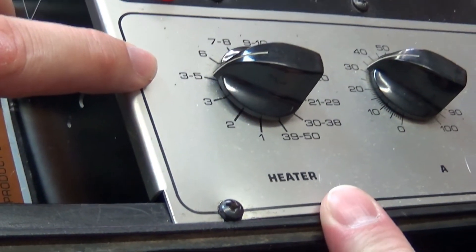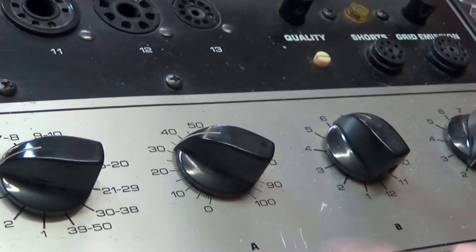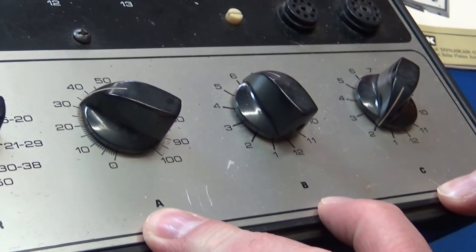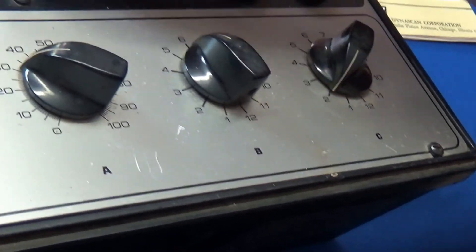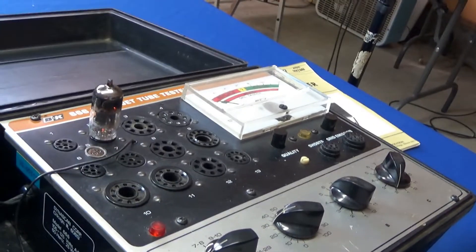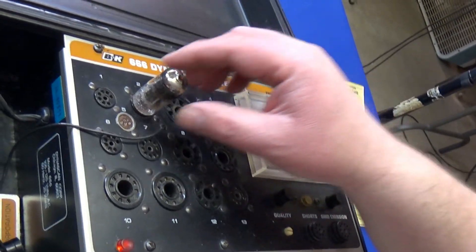That's pretty easy to tell by the first number off your tube. So it'll be 5 volts. This is some of your bias — these are your bias controls. But the manual tells you what these should be set to in each case, and which socket. It says, do here, then here, then here, then here — and you just do it. So that was this tube, and it's already hot now. Tubes get hot.